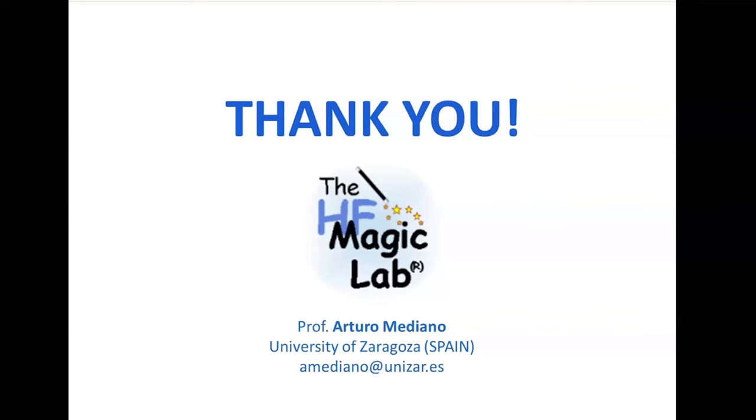The first question is about a 1 microfarad AC film cap. Yes, you can have a 1 microfarad AC film cap. This is for DC, what about AC? The AC voltage is already reduced when applied to the measurement device. I am not sure I understand the question. For AC, it's exactly the same idea. The filter is a low-pass filter, so you can pass DC, or you can pass 50, 60 hertz, and the circuit is exactly the same. It's basically a CLC filter. I am not really sure I understand the question, but it's basically the same idea.